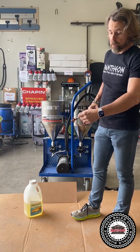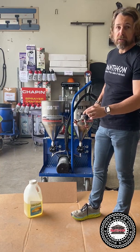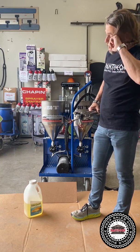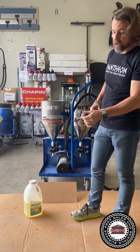And the reason we do the threads is because it really helps become a bond breaker. If you have a little bit of that isocyanate that's gotten in the threads, it's a booger to get off, man. It's really difficult. And sometimes you're messing up the, you're definitely messing up the threads, you're messing up the nut. It's just, sometimes it's impossible to get off.